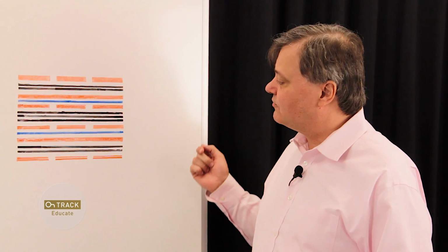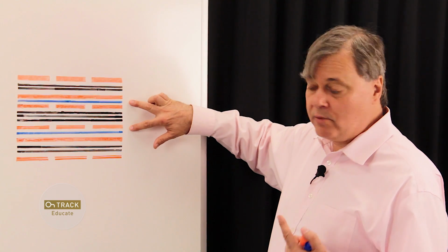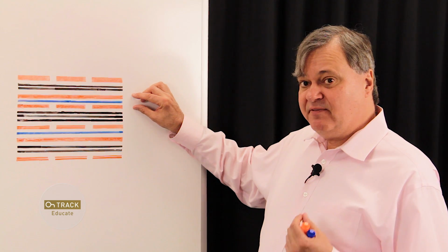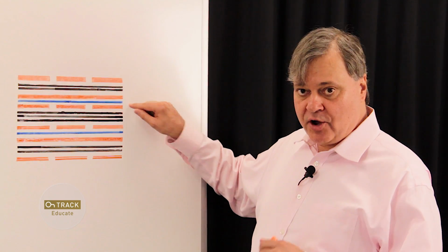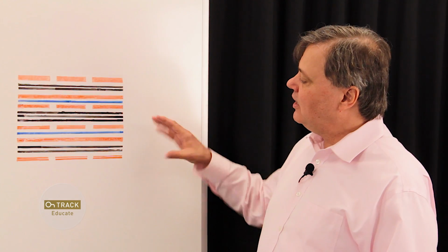So let's look at some of the features of this. The black lines represent pre-preg material, the blue lines are core material, and the orange is obviously my copper layers. I have 2 planes and 4 routing layers. Now, for your high-speed signals, these need to be very tightly coupled to a plane layer. So this core material needs to be as thin as possible, and we need to use core here because this is going to be impedance driven. So we need a very flat surface to guarantee that we have consistent impedance down the length of our routed traces. Then our outside layers are pre-pregged to the entire stack up.